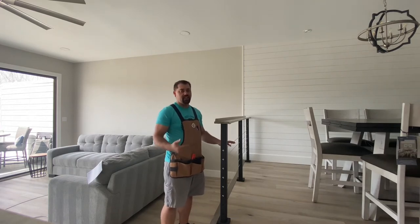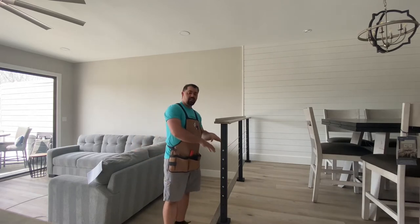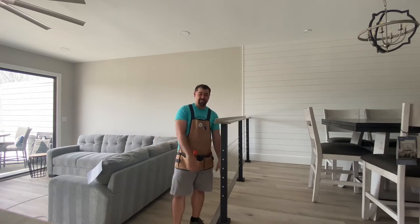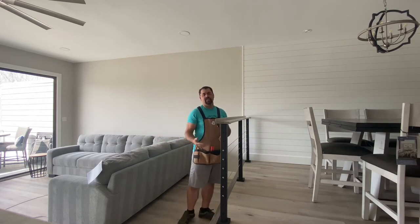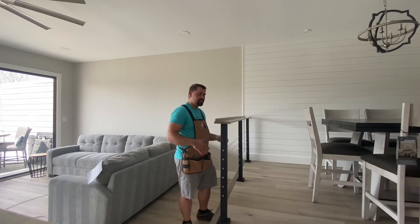And so I worked hand in hand with the client to make sure that the contractors who were doing the work on the flooring stacked and blocked joists beside each other from this outer edge here to about 7 inches inward. That way, no matter where I drove my lags, I would be hitting not just subfloor. You really need to hit joists below subfloor. So just be wary of that.